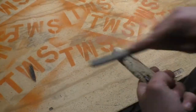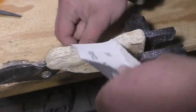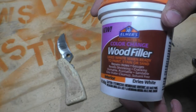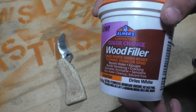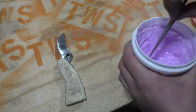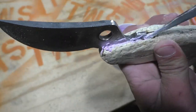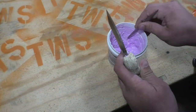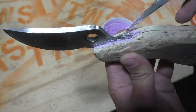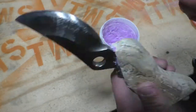Once that is accomplished, I take some files to it, finalizing the shape once more, and then finally I pass over the whole thing with some hand sanding. Now let me stop right here and explain something. This wood filler is a great idea if you're going to paint the handle. However, I'm planning to stain the handle because I want to keep the look that the oriented strand board gives me. So I should have used a wood filler that is the same color as the wood. But let's assume that you want to paint your handle — that way you can use any wood filler you would like. After filling in all the voids, it's time to give it one more hand sanding and move right along to staining the wood like it was a white t-shirt.